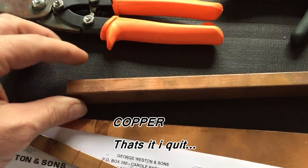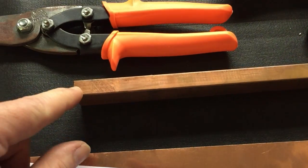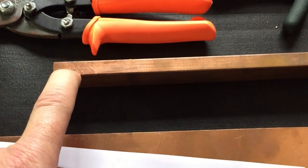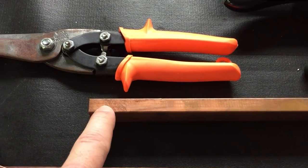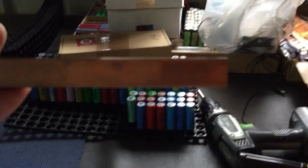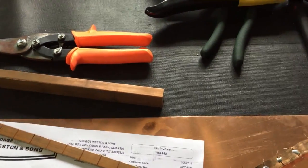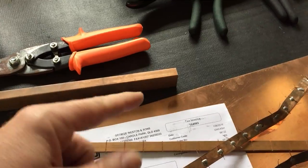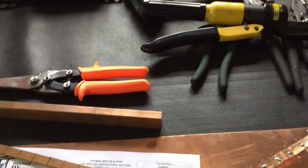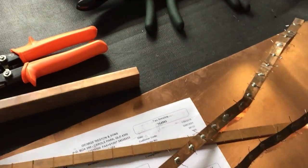Now, because it's such a chunky piece of copper, some people have said I talk too fast but that's fine — it's my channel, I'm Aussie. I'm going to tap and drill a hole in the side of that bus bar at the back, so I can attach the BMS hardware to the back where you can't see it. That maintains a little bit of looking good — because that's the whole ethos: I want it to look good and function right.